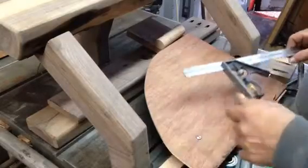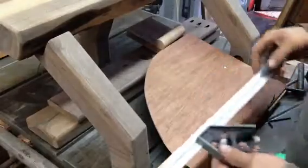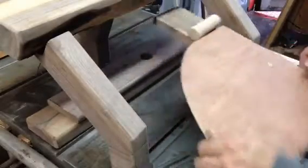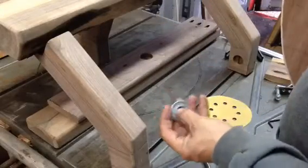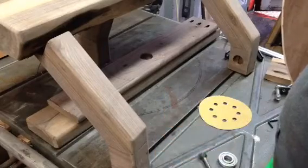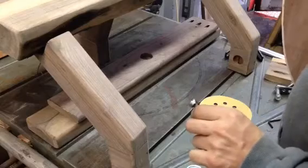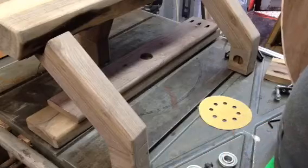This is going to be about making the base. A few tools you're going to need — one is your tri square. And depending on what size pocket bearings you use, these particular bearings have a 5/8 inside and 1⅜ on the outside, so I use a 1⅜ inch Forstner bit to recess these with. I also had an 11/16 Forstner bit to allow the shaft to clear.